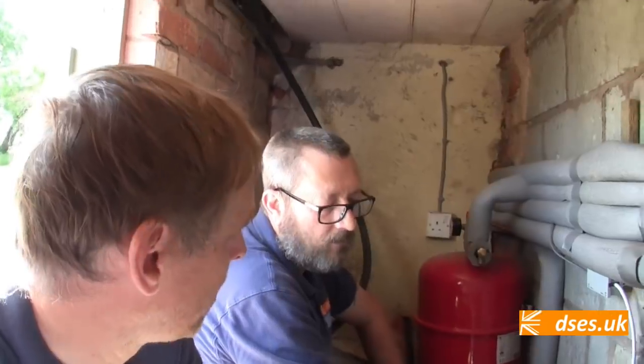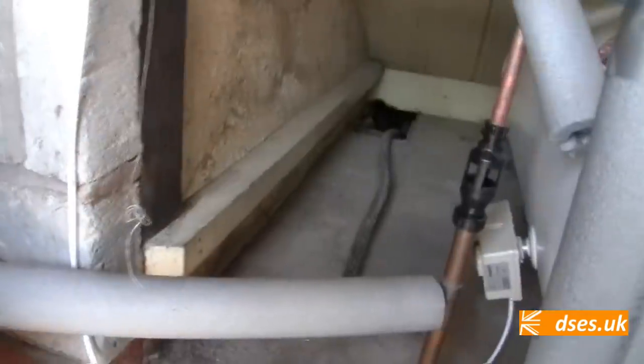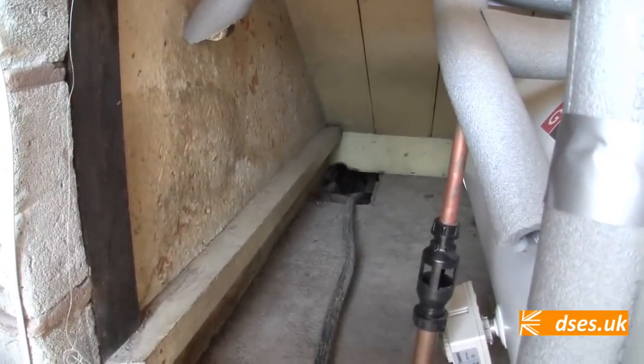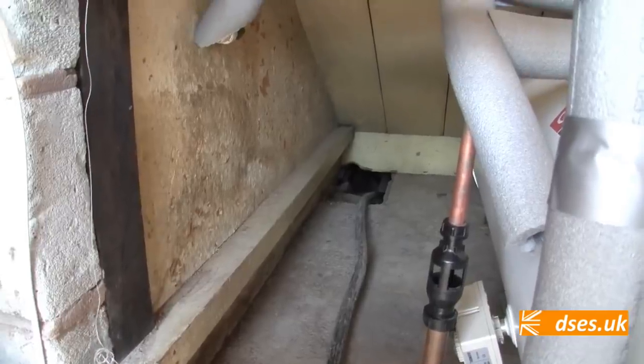And then we've also got 10 metres of 10 mil, although we perhaps only need half that, but that would allow us to pull that back under the floor to a certain extent, so the resin joint will end up sat under there somewhere, never to be seen again. But nor should you need to. No. As long as we make sure that it's all done and tested before we commit to pouring the resin.